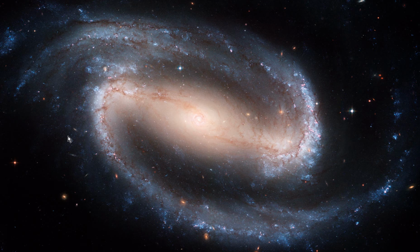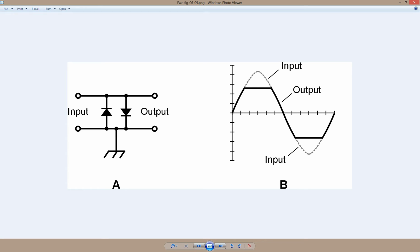The topic of this video is to show you an old technique used by shortwave radio operators and ham radio operators with older receivers that did not have automatic gain control. So if you were listening to a weak signal on CW particularly, and a strong signal came in, it would do something called blasting, which if you had headphones on, you would fully understand why they call it blasting. It would practically blast your head off. It would be so loud.